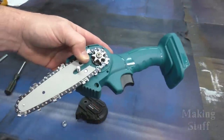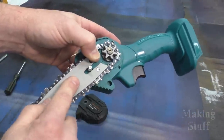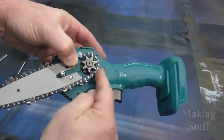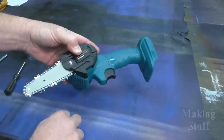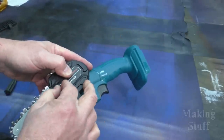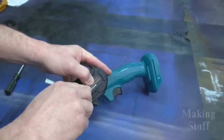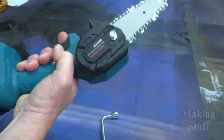Assembling this is very easy — it's just like a regular chainsaw. You just put your chain on the bar, then put your bar onto the tool, making sure that the tensioner is in this little hole on the bar. Make sure the chain goes around the sprocket. You don't want it too tight or too loose, just like a regular chainsaw. You set the tensioning right here with that screw, and then once it is all set, you just tighten down the cover and that holds everything into place. So this is assembled and it should be ready to go.